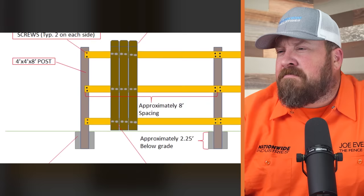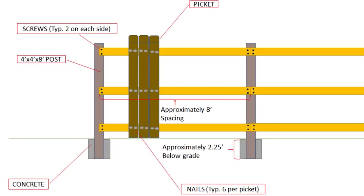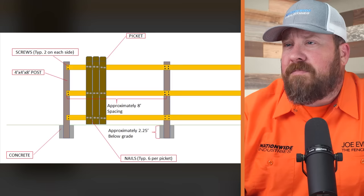A 4x4x8 post suffices in the southern half of the United States, predominantly where the frost line doesn't exceed two feet. To meet ASTM standards you'd want holes to be 30 inches, though you can float the post in that depth. In northern climates you'll have to go significantly deeper to get past the frost line. The danger of not setting posts deeper than the frost line is that over time the frost will heave that post up out of the ground. His diagram shows two and a quarter feet — not quite the 30-inch ASTM, but better than the 24-inch you see in a lot of cases.